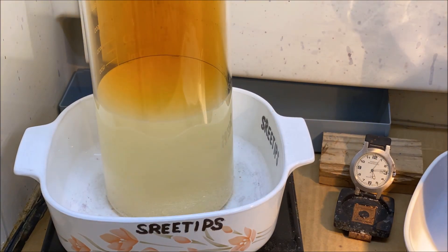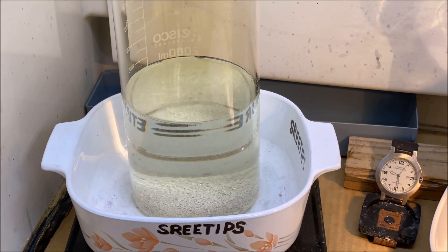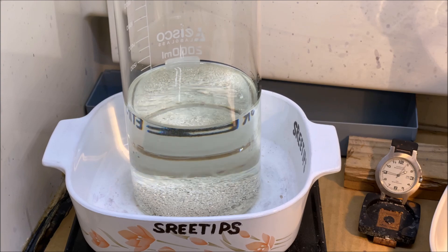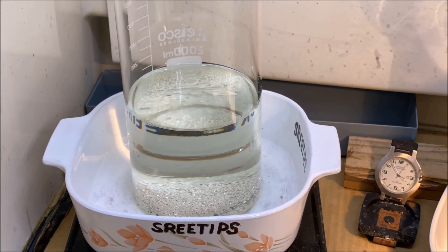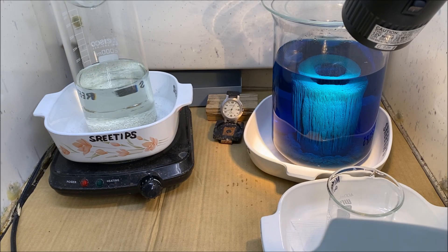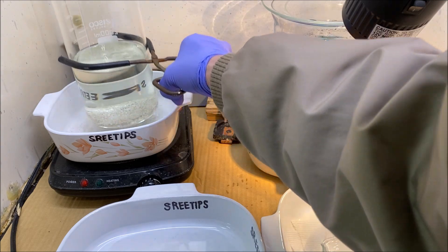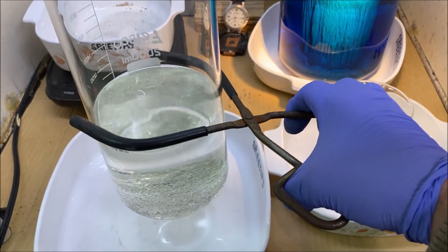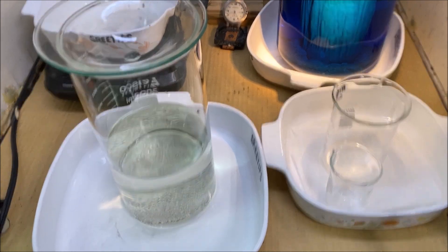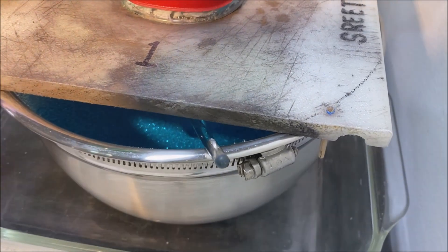This is about a 12-hour time-lapse and you can see that every bit of the silver got dissolved. I added some more silver crystal halfway through because I want to make sure there's a little bit of silver left in the bottom of that beaker when the reaction is complete. I can tell it's complete when all the fumes are gone. After over 12 hours, all the fumes have cleared and there's still a little silver left in the bottom, so I'm quite certain that every bit of the available free nitric acid has been consumed — I don't want excess nitric acid in my electrolyte.